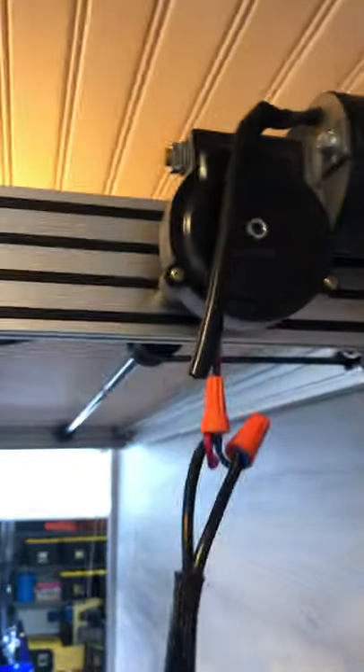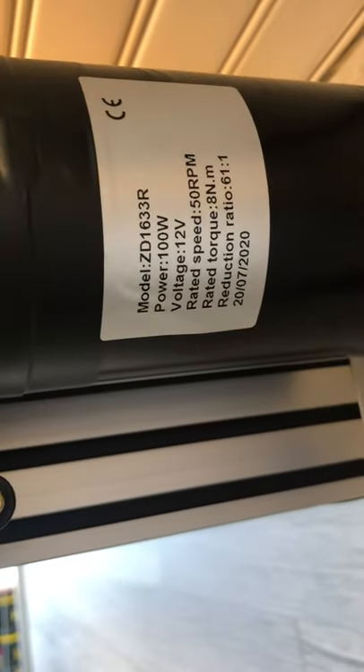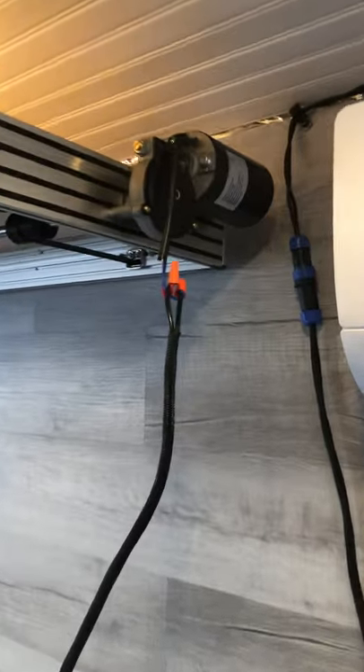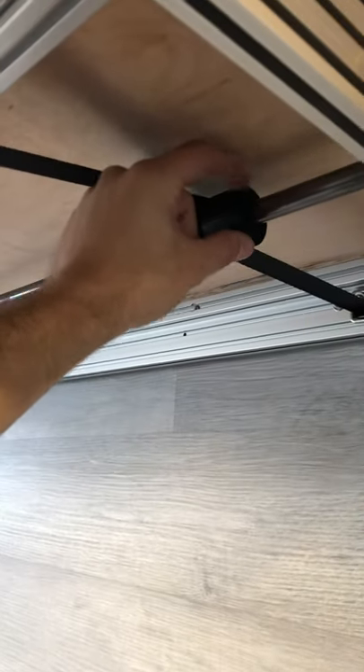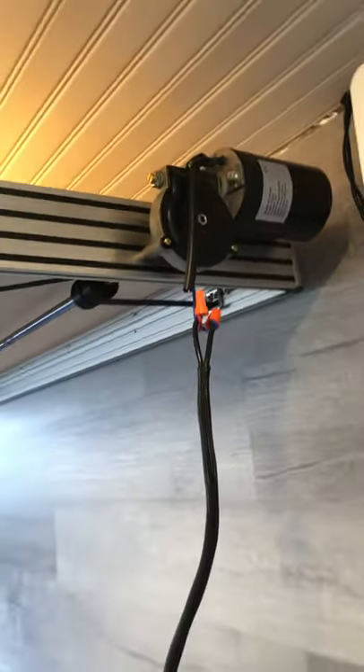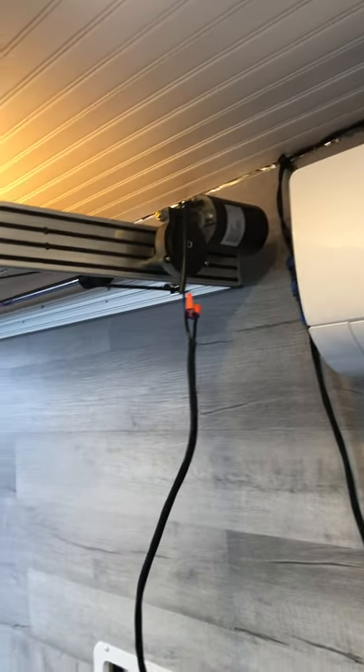The motor is a worm drive gear motor, 12 volt. Here's a zoom in — these are used for tarp motors on dump trucks, and I've also heard they're used as windshield wiper motors. You really just need a 12-volt gear motor or equivalent to spin the shaft. If you go with a shaft much bigger than an inch you might need a slightly higher gear ratio, but that motor seems to do the job with room to spare. I did end up bolting the individual members through the outside because I didn't get enough angle brackets for the inside.